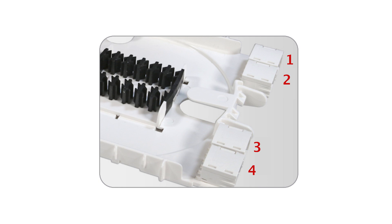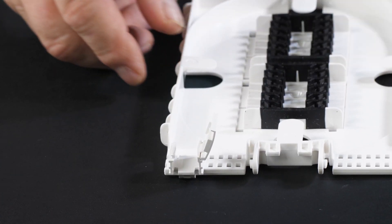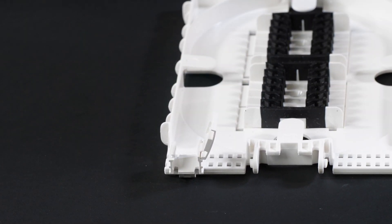These v-clips may be installed in up to four locations on the APEX splice trays. Open the cover of the v-clip, slightly squeezing the base if needed. Ensure the cover is engaged and the v-clip is free from contamination.